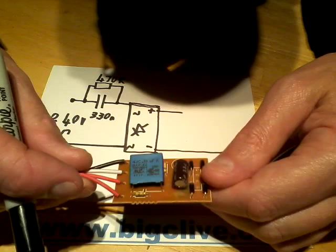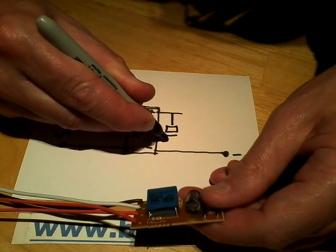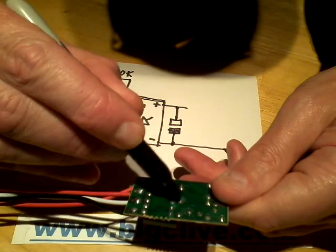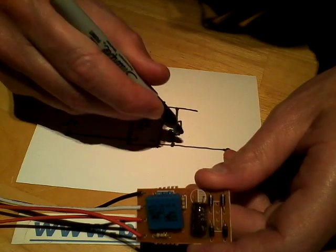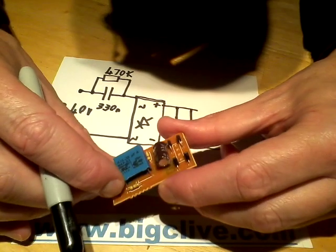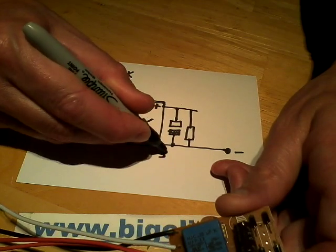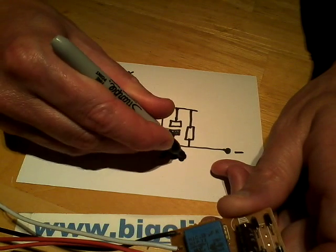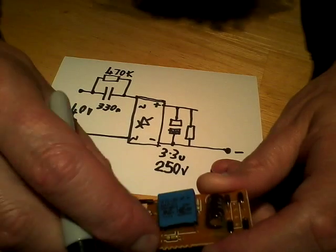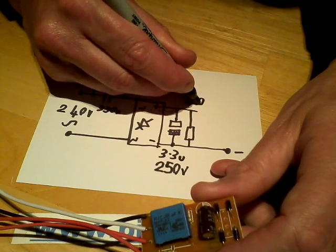and there's a capacitor across that. And it's also got a discharge resistor across it. The capacitor is rated 3.3 microfarad at 250 volts. 250 volts is just a wee bit too low if it goes open circuit. 3.3 microfarad, 250 volts. And the resistor is, again, 470K.